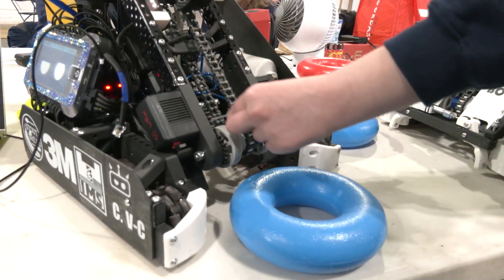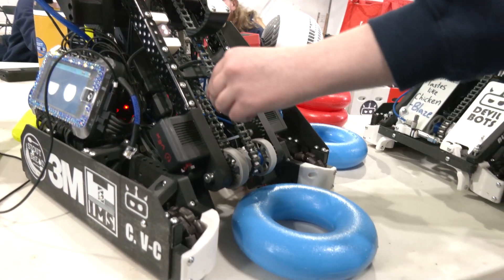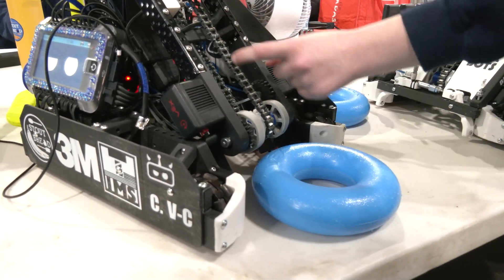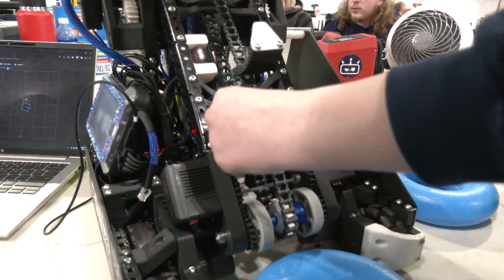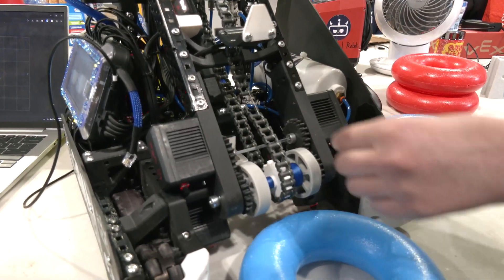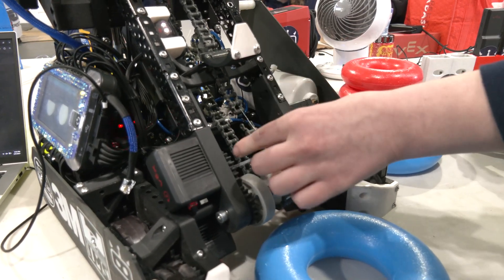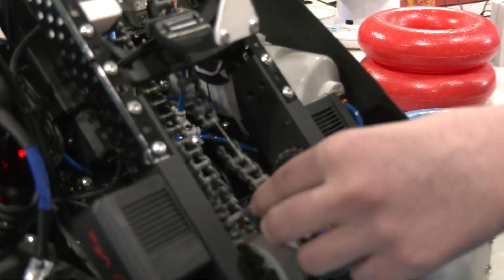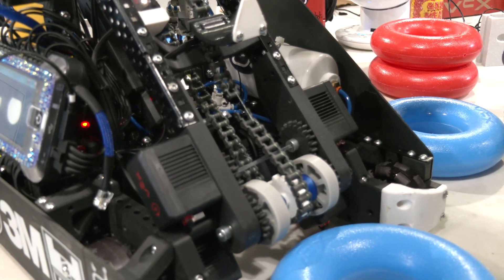The curve geometry also helps pick the rings up. We also had issues with the chain itself separating — if it gets caught on something it'll pop the chain open. That usually doesn't happen, but our robot can still function if it does. In a previous match before we installed the string, we had a chain fall off and get caught in the drivetrain.